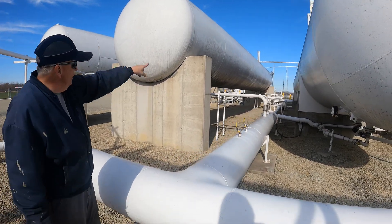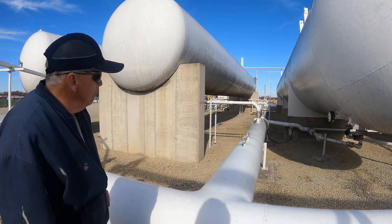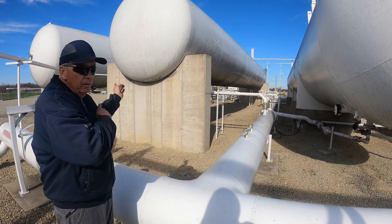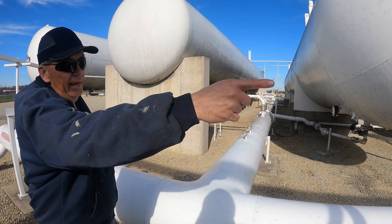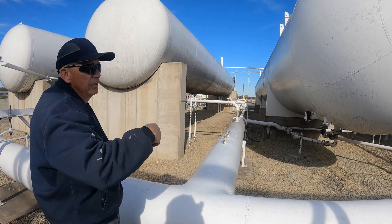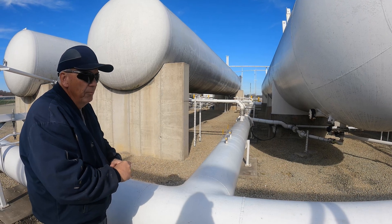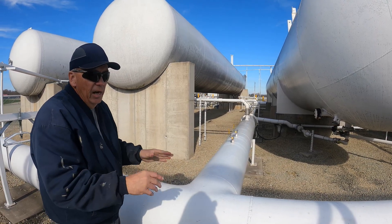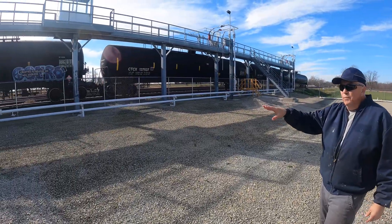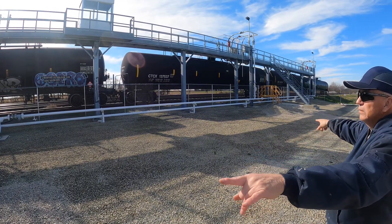The redeeming thing is it's a 60,000-gallon tank with a lot of weight in it, and it's a six-inch nozzle opening rather than three inch, so that helps a lot. Those are my drops going into tanks three and four from the rail cars — since they come off the top of this, propane vapor has a place to go right up into those tanks. Since that end is like a deadhead, that's why we put a three-quarter-inch line there and ran three-quarter inch to the top of tank one.